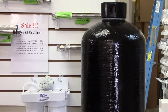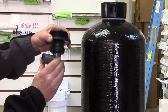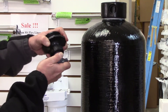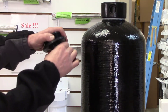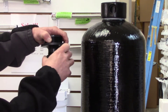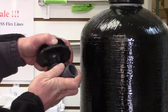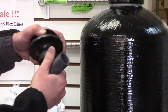The fitting on the bottom of the tank is called a clack swivel fitting. As you can see, it swivels around so you can align it to your pipe and the outlet at the bottom of the tank where the hole in the base is. These fittings have a little bit of movement that gives it that swivel. The nut is tightened down to these stops and there's an o-ring which makes the seal on the inside — you can see the o-ring and the chamber where it seals — allowing it to move a little bit and swivel around while still being a watertight seal.